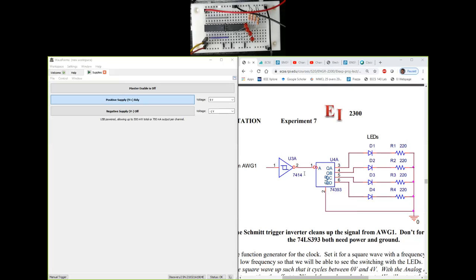The outputs of the 4-bit counter are available on pin 3, pin 4, pin 5, and pin 6. Those are connected to 4 light emitting diodes, D1, D2, D3, D4. The negative side of those diodes, which are essentially the shorter leads, are connected to resistors R1, R2, R3, R4 and connected to ground. So whenever we have a QA going from 0 to 1, LED D1 should go from off to on. So if it is blinking, that shows me that the counter is counting. So that's how I've set up the circuit over here.